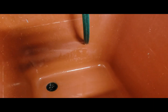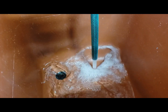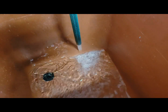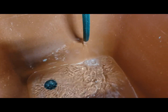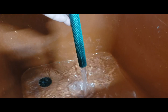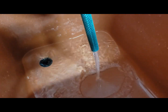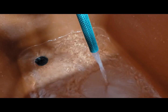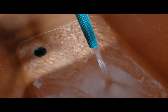And this is a pain in the ass — we cannot have this. So what happened now: I am going to open this up here. All the water with pressure is going to run out. There it is — that was the click from the pump. The pressure is getting lower and lower, and pretty soon the little one is going to kick in. I have this set really low because it is an old pump, and there it is.